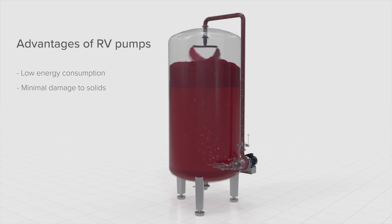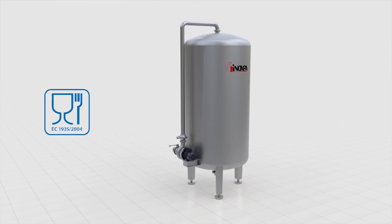Unlike other fixed platform pump over technologies, RV helicoidal pumps can handle high must without clogging between pump over cycles as the impeller is offset from the riser. There is no need to use a screen and sump, liberating labor and expense. Low maintenance thanks to the small number of components and robust construction. The RV helicoidal pump removes unplanned extraction to maximize winemaker influence of flavor and color extraction.